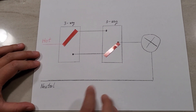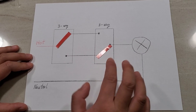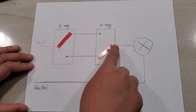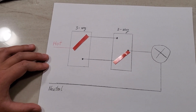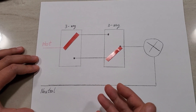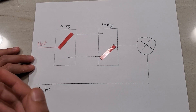Since you only need to keep a dumb switch on the second location, if you want a dimmer on the light you can actually buy a dumb three-way dimmer switch. This will allow you to adjust the brightness of the light using that dumb switch, because I don't think there's any smart three-way dimmer switch on the market. You won't be able to adjust brightness from your app, but at least it's better than nothing.